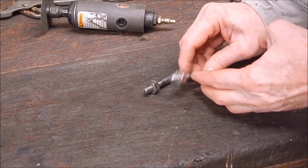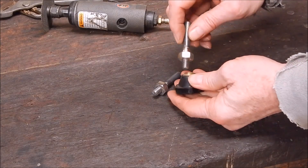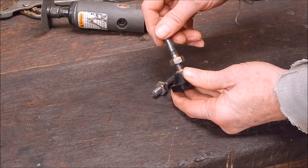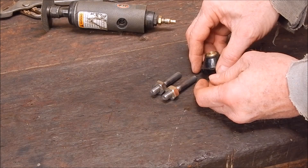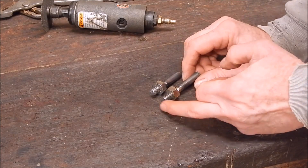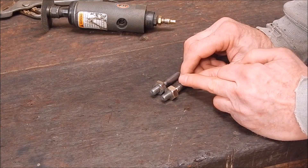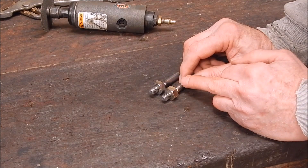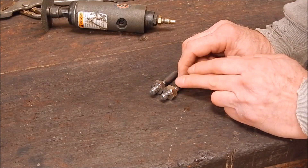You can see that the job turned out okay. There's no bleed-through onto the actual thread area we're going to use. Our knob will just go on like so with the welding cable tab in between. This will fit up inside the cable connector and we'll be able to use long cables on one of those universal male-female connectors. I'm using a steel bolt - should it be brass? No. Steel's quite okay in a welder. In fact, some of the cable connectors you buy are actually steel and the outlets on most old welders are steel bolts. There won't be any voltage or amperage drop - when you weld it's going through steel anyway to complete the circuit.